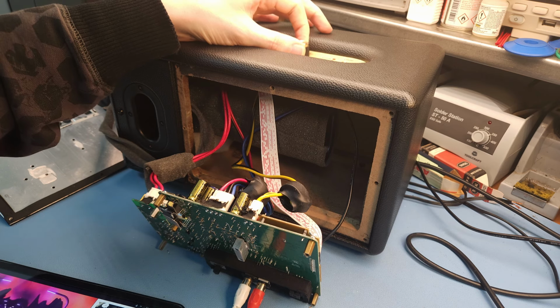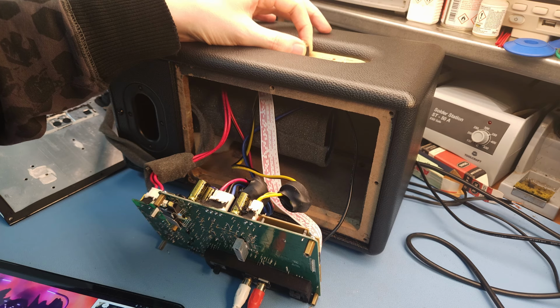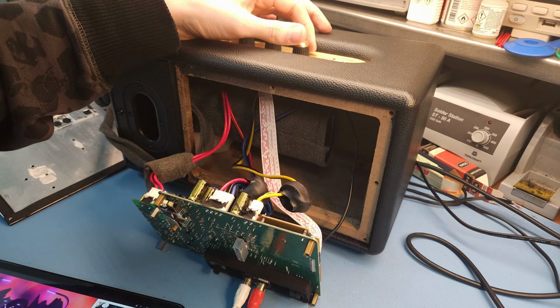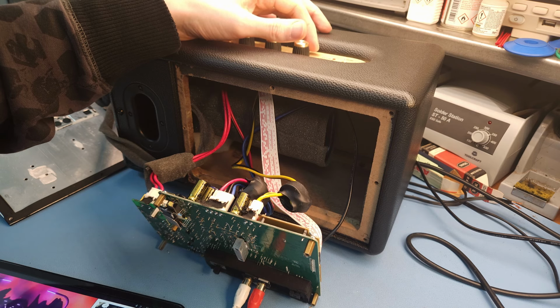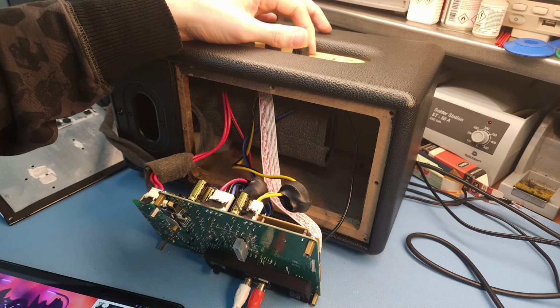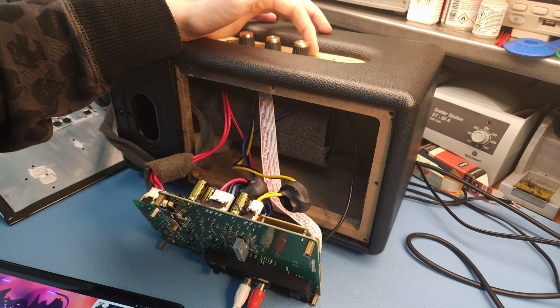Looks like everything is holding up so far. Let me take it off the dim bulb limiter and then we see if it holds up again, because like this it was also performing before the last repair, but then when I took it off the dim bulb the fuse blew and everything went haywire again. So let me take it off the dim bulb limiter and then see if everything is still going fine.